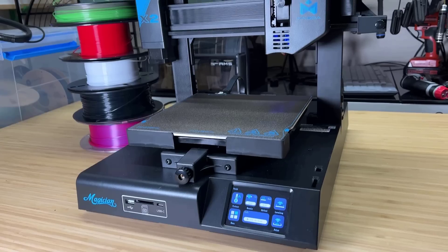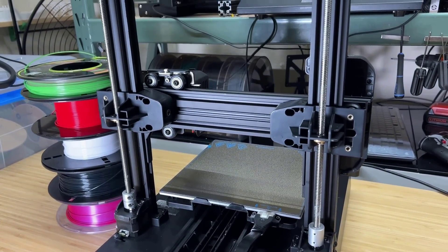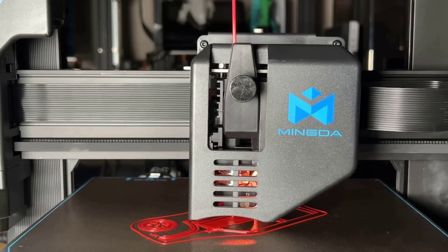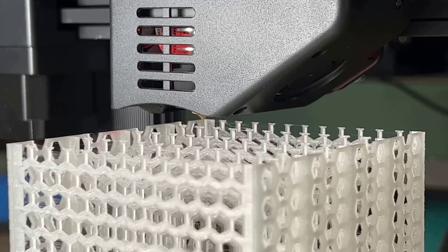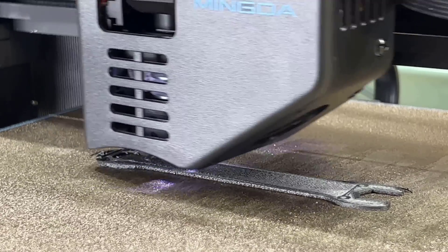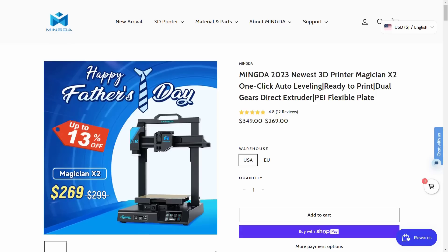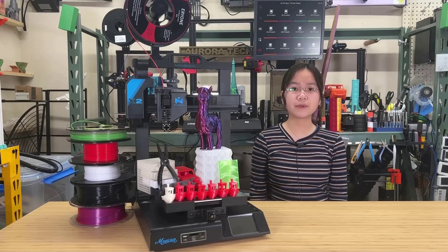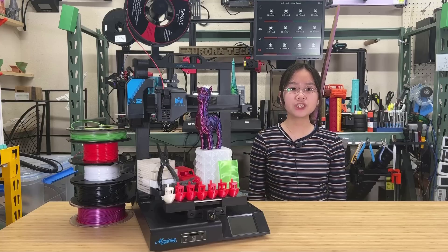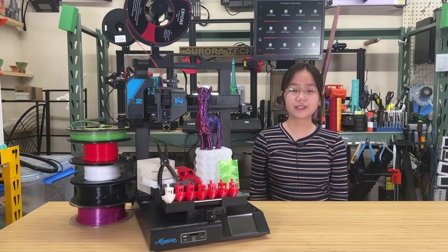In conclusion, the Magician X2 is a solid printer. You will not see any other budget or mid-range printer that comes with this many custom injection molded parts. If you are not looking for fast printing, the overall print quality is pretty good when you print at a regular speed of around 50-60mm per second. It can also handle engineering-grade materials like polycarbonate and nylon carbon fiber if you spend another $30 to purchase the high-temperature hotend, bringing the total cost to around $300 for a broad range of filament. As the assembly is easy and you just need to set the Z offset using the screen menu, I would also consider this to be a beginner-friendly machine. If you are interested in the Mingda Magician X2, I put the link under the description. If you found this video helpful, please consider giving it a like and subscribing to our channel. Thank you for watching.